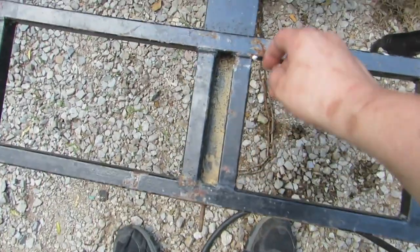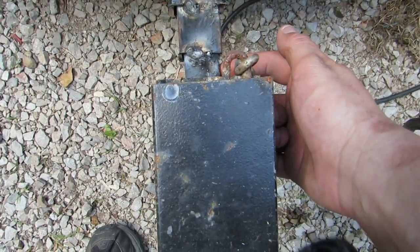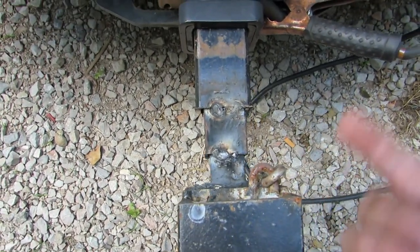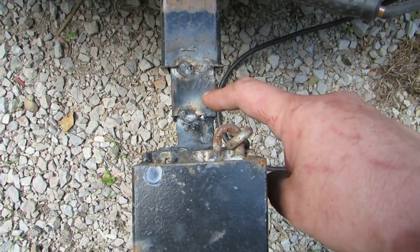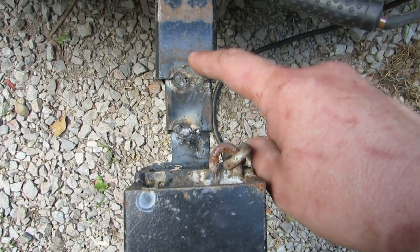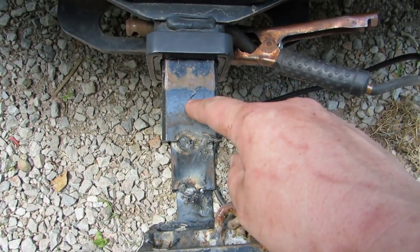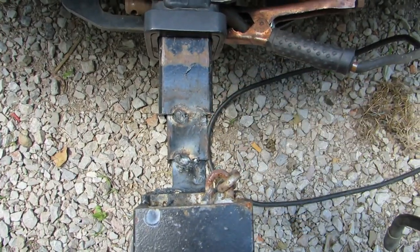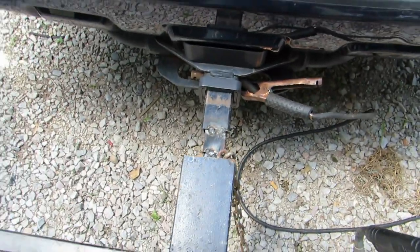What I've done — this is all one-inch square tubing, three-inch c-channel, and down here it's all welded to a one-inch receiver, because that's what my Del Sol took. So I could slide this into the receiver hitch and bolt it on. What I've done is take that one-inch to a piece of inch-and-a-half, got a weld on it to hold it, and put that into a piece of two-inch for the receiver hitch. This is actually an old receiver hitch that we bent, so it wasn't safe anymore — I just cut it off, put it up on here, and put a little spot weld on top to hold it. About to pull it off and weld it properly.